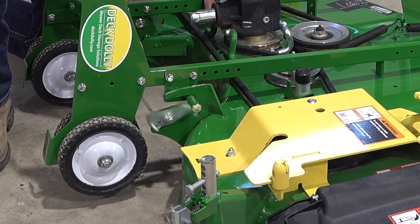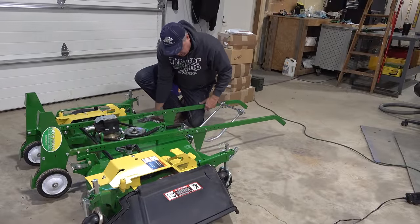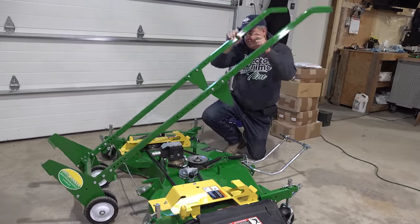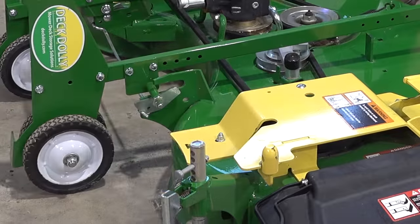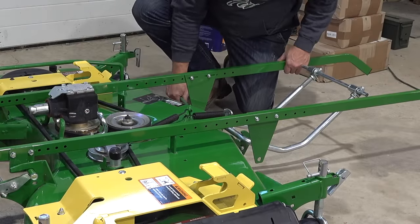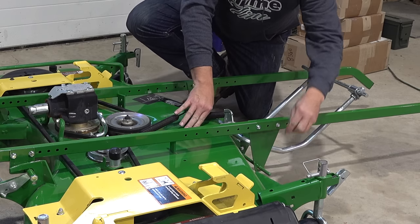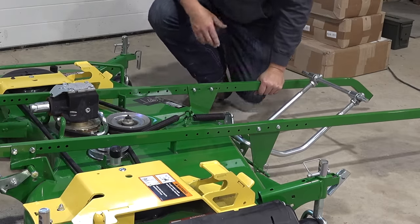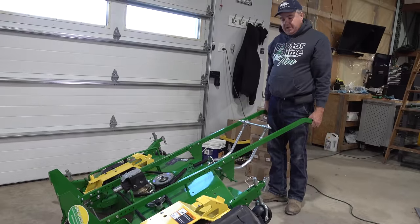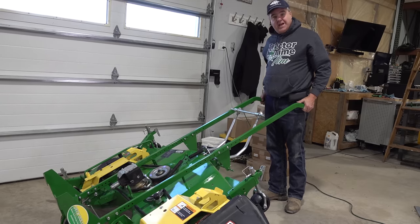I'm going to remove and then reattach this Deck Dolly so you can see exactly how it works. First thing I'm going to do is lower the pin here — this is just like you would do on the tractor. Then I have to remove a rod up here. I pull out the key, I pull the rod out, and then I can simply back the Deck Dolly off. It's fully unhooked at that point. Now to put it on, I just lower it right back here, let those bolts go right in there, pull it on until it auto-attaches and latches for itself. I lower it here, put the rod back in, put the key in, and I'm ready to lift it and go. It's a manual lift at this stage — it's not incredibly light. If you have the Load and Goes, that's better. But this is a lot lighter than trying to lift the deck closer to it, and you do have some leverage that works in your favor.